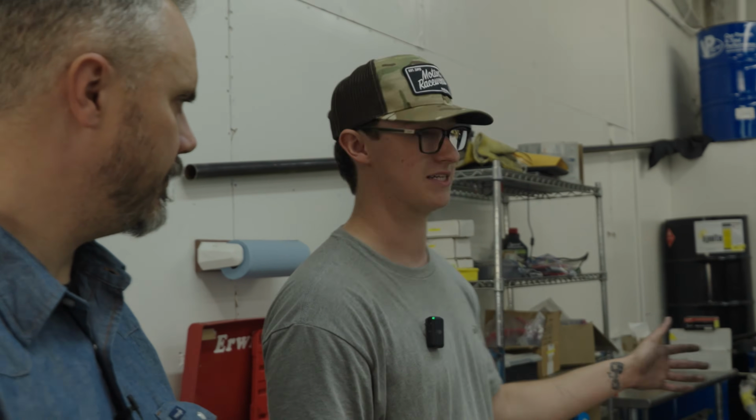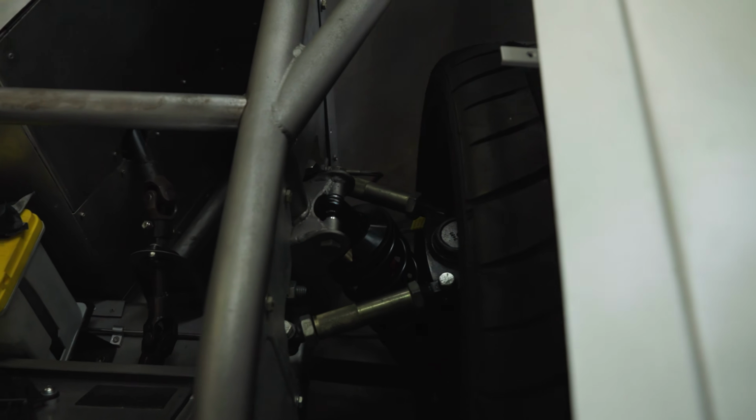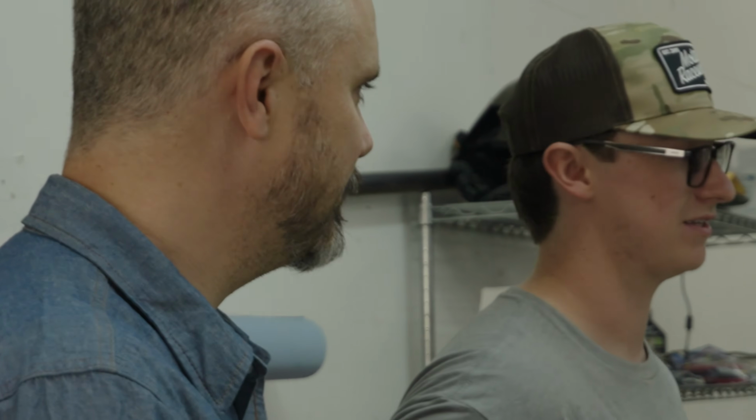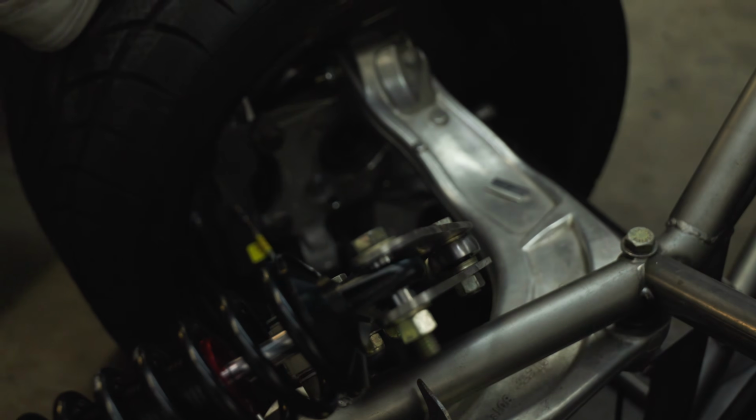The front utilizes Mustang 2 stuff from No Limit Engineering. The rear is all based off of a 5th-gen Camaro that I built a cradle up and then used those pickup points to build a chassis around. I'm trying to think of what I bought for this thing that I didn't have to either modify or change eventually. Are you saying there's not a Chevy Luv truck catalog out there to turn this into a time attack car? Sadly not. I wish there was, but that would ruin all the fun of learning how to do everything.